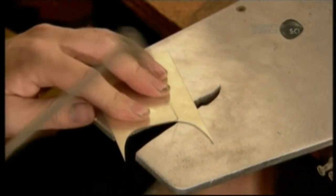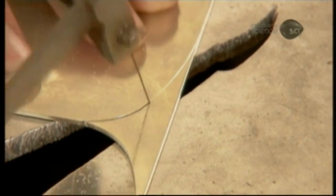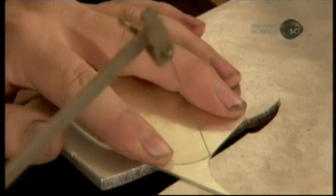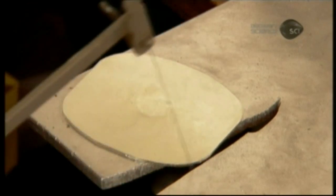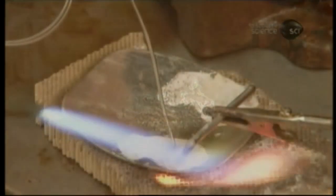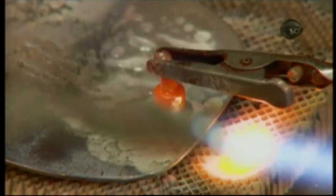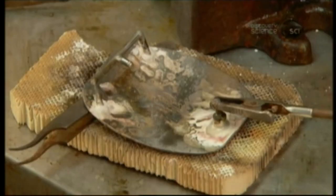The buckle maker uses a jeweler's saw to cut the shape of the buckle from heavy gauge solid sterling silver. He stamps the company logo into the back of the buckle. Using pure silver, he solders the welded rods onto the back of the buckle, along with a stainless steel keeper tongue.